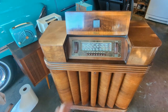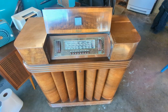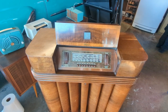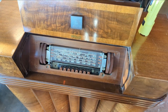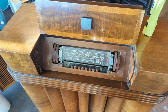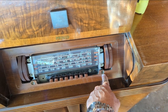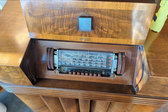I'm really glad the cabinet is just marvelous. In a few minutes I'm going to be reminded why I should not be working on this because I'm going to be aggravated — as soon as I take that chassis out, I guarantee I'm going to be met with a freak show of wiring and capacitors. Now, something important I remembered about this model: otherwise you're going to scratch your brain trying to figure out how to remove the chassis. You have to remove the metal escutcheon and then there's two screw holes — remove those and then you can pull the chassis out. The first time I did this, I spent an hour trying to figure out how to take it apart.